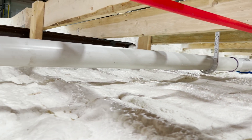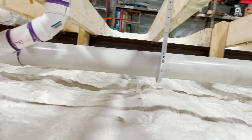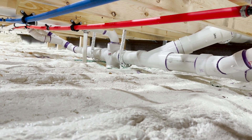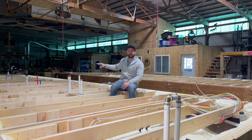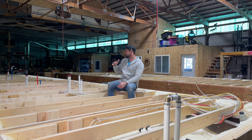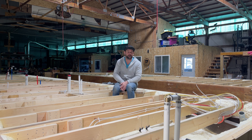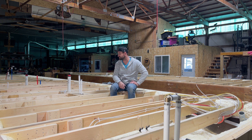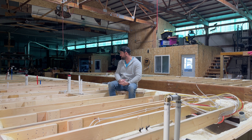With the waste line, it's a bit less. I pressurize my water waste line as well — I cap all the ends again and bring that pressure to five PSI. That's going to need to hold for at least 15 minutes, but if you've got a good system it should hold for about an hour. What's going to fail on that system is typically the screw caps where you're capping off the ends.